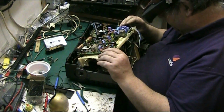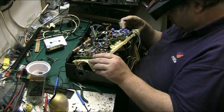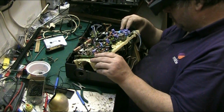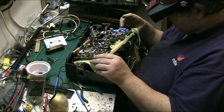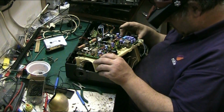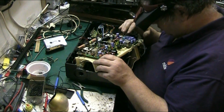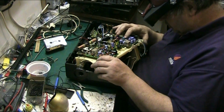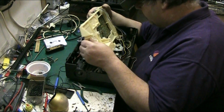I am actually going to do capacitors. I mean, I don't like the look of some of them under there. Ew. Yeah, I think some look okay. 10 volts at 1000 microfarads. I don't know if I've got them in. Smoother looks okay. Just around this area here, these big ones. Looks like them black ones there have been replaced in the past. That's what it looks like. Might be wrong, but let's have a look.